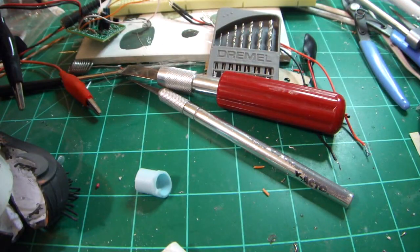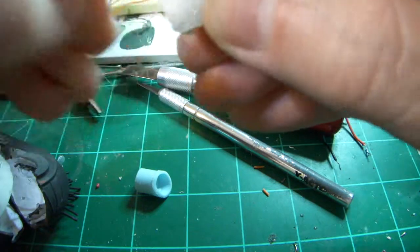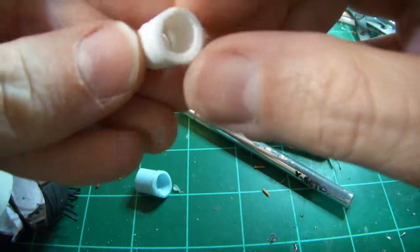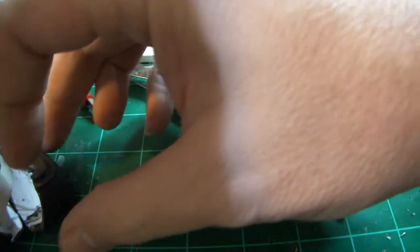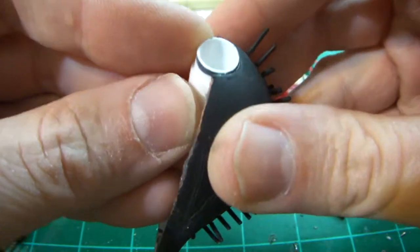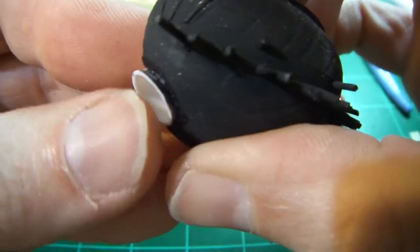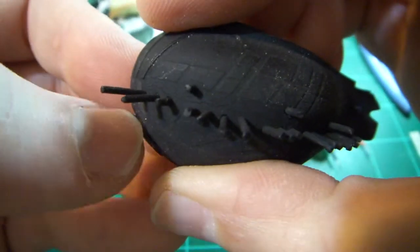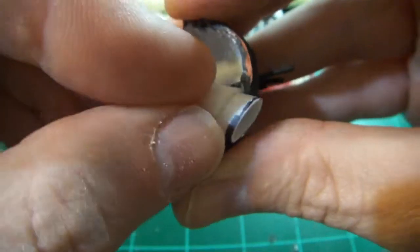So what I decided to do was to try to build my own piece out of 7/16 styrene tubing and a 3/8 styrene tubing, and that's what this piece is right here, where I have two different pieces of styrene, one inserted in the other, cut at the appropriate angle, where I can actually insert this into this point right here and sand this lip down to match the front surface of this piece. So that's what my intent is to do,